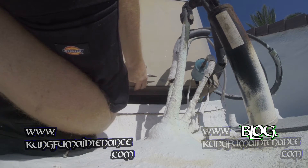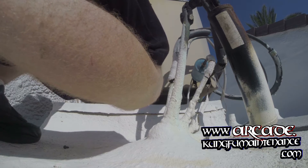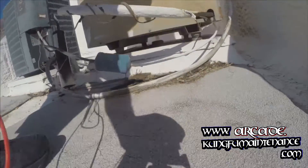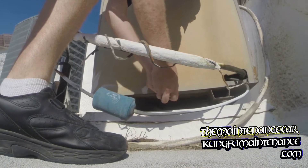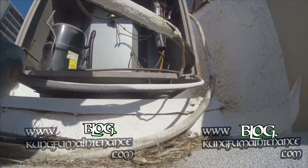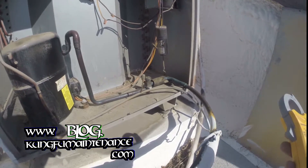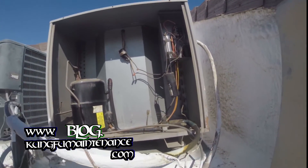It is on a 30-amp breaker, so even at 16.5 amps that's still not necessarily enough to blow it. But most breakers are generally only running at about half capacity. Let me find another one I can test. Same thing — just one wire. 7.6. Yeah, we definitely have way high amp draw on that first one. So I'm considering replacing the unit — probably a good idea.